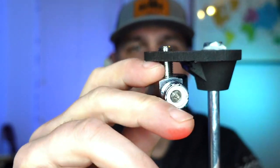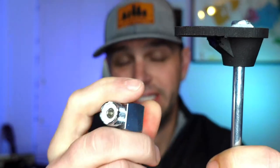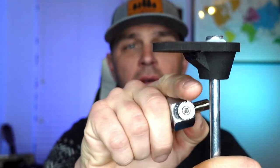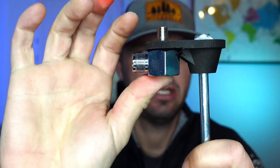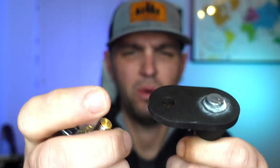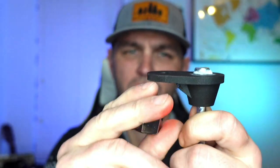If I were to put the elbow connector in the same way, you can see it's not going to fit — there's that gap. The reason is I didn't go as deep on the 45-degree angle support for the Dude Spike, but now I can go ahead and put this on the side. I think that's going to be good for at least testing purposes. In the future, I'll go ahead and redesign this and get some new ones printed. I was also considering extending just this circular piece out a little bit more, which gives me the opportunity to still keep that 45-degree angle while still fitting the whole elbow connector in.